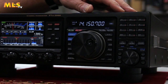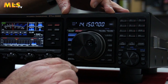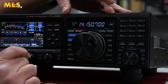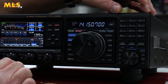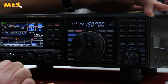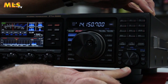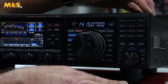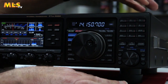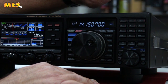On the right hand side of the display, you have the main VFO tuning knob, and right above that you have the main frequency display. This is one of the main differences between this radio and the 1200 — on the 1200, the frequency display is on the main TFT display. To the right of this, you have all the band change buttons where you can enter all of the bands. If you want to do 5MHz, you just press the enter button, type in the frequency, press enter, and away you go. To the lower right you have the sub VFO or clarifier — it's a dual mode control. All the rest are fairly self-explanatory, and as I said, this is one of the main reasons why I like this radio. It's just very nicely laid out and very easy to use.